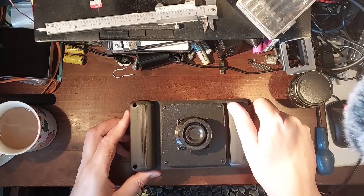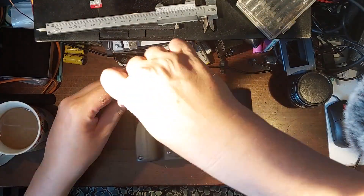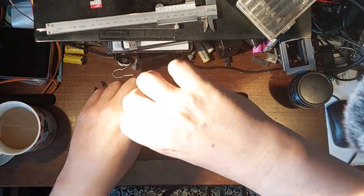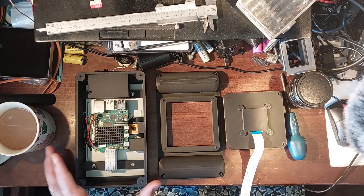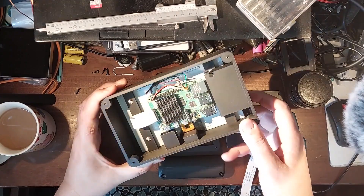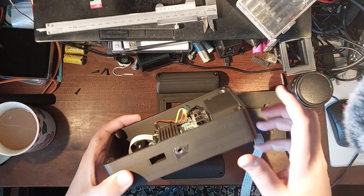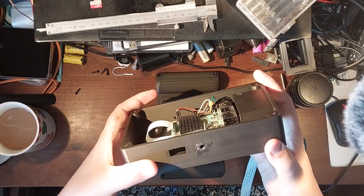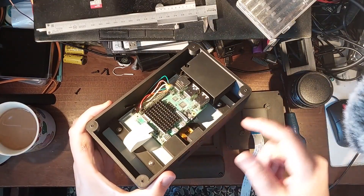Let's go through it and see what it does. It's a device of three parts. The main chassis is just a box to take the Raspberry Pi screen on the front, and the Pi 4 is mounted onto the back of it. I put an opening in the side to get at all the ports, and another opening to get at the USB-C port for power. There is a hole in the bottom for a tripod — just big enough for a 1/4-20 screw to bite into. I have a 1/4-20 bolt which I've used to make that thread.